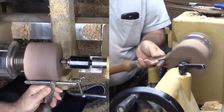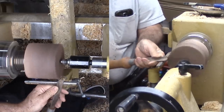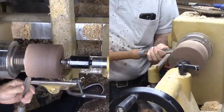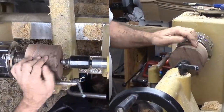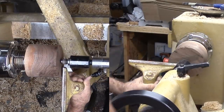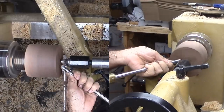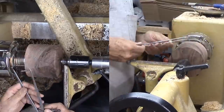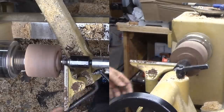I've mounted a small block of walnut to the face of my chuck jaws with tailstock mounting pressure. I had rough cut off the corners on the bandsaw. Rough is just fine — no precision here as long as I stay well outside where round is. Cutting off the corners saves only a little time. After roughing, my task is to cut a mounting tenon into the blank.